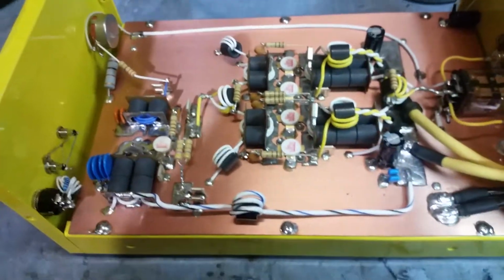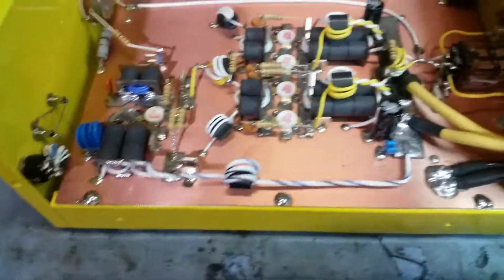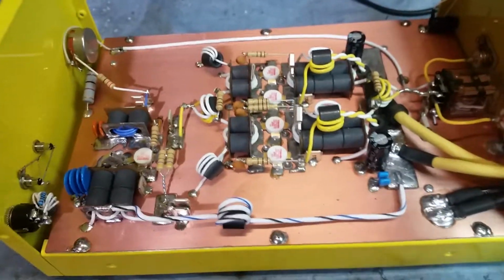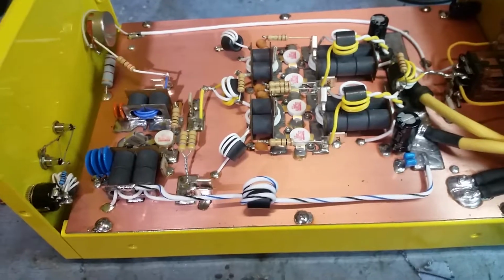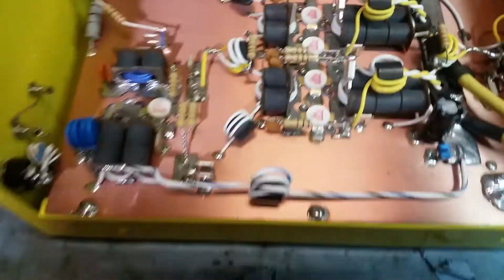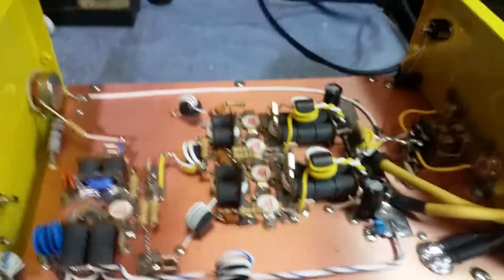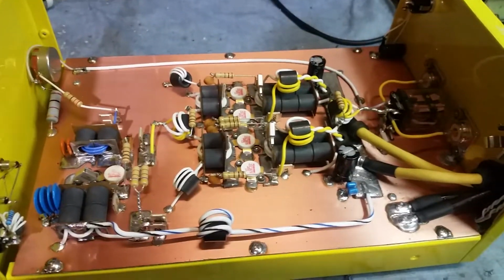so we gave you all metals like you wanted to. And of course, anybody else here watching, it ain't like using all metal capacitors is some kind of voodoo or something. It's just that the metal clad capacitors can get a little bit hotter than a silver dip mica and keep its value. See, the problem with a lot of these boxes is the hotter these capacitors get on the fly, meaning while you're using them, they can actually drift in value. They can change value on the fly.